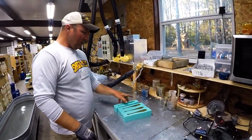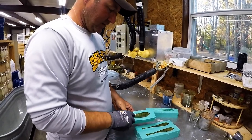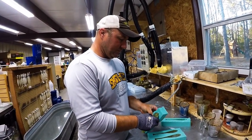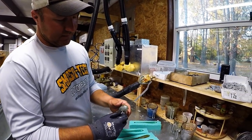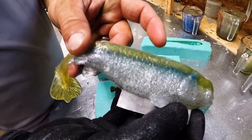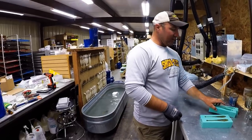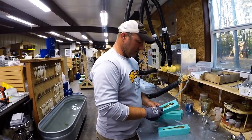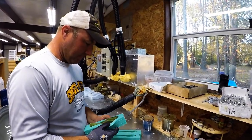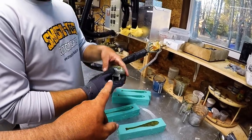They've cooled just enough to get them out. In this mold you've got to be real careful — there are lots of little details. They've actually got scales molded in, and the tail is shaped really different. You can snag them and tear them getting out. To speed up the process, I'll dump them in a big tub of water. And for the record, this color he just poured — that's the light hitch — is hands down the best big swimbait color in my opinion.